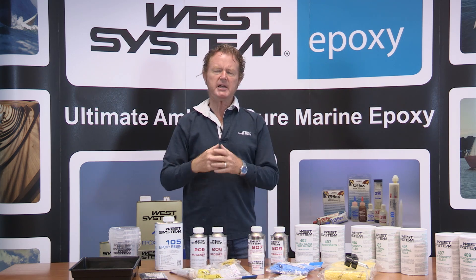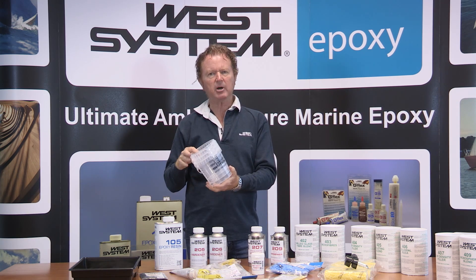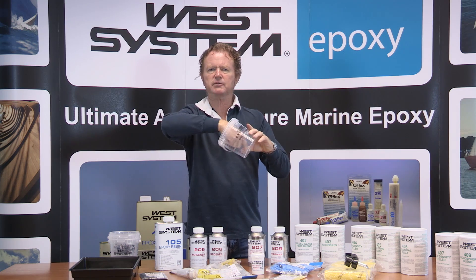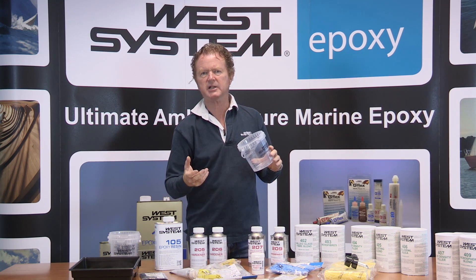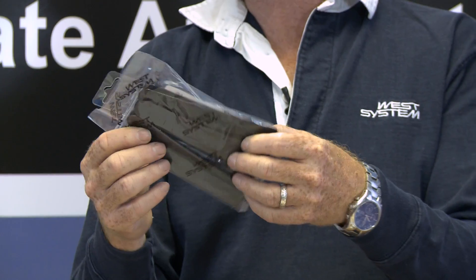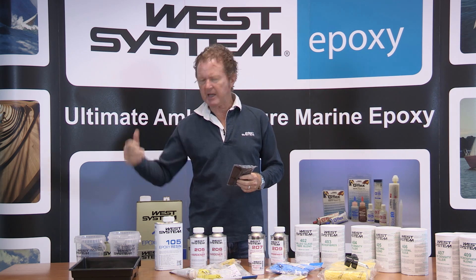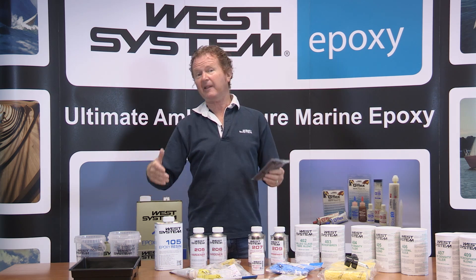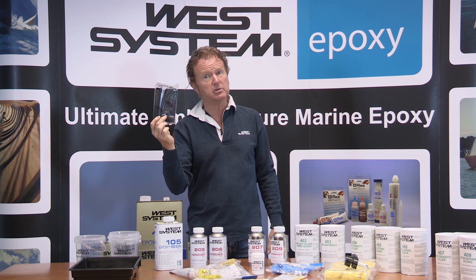To make a good job you need excellent tools. We have a range of mixing pots that make mixing very straightforward, because there's a very straight edge to them and no rebate on the inside for any residue of unreacted material. We have these plastic mixing sticks — how many times have I seen people using sawn-off pieces of wood that deposit contamination and sawdust into their work, and they always complain of a poor coating. These make life so much easier and they're reusable.